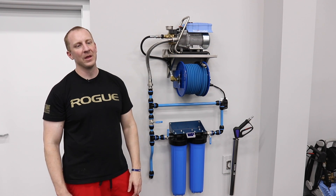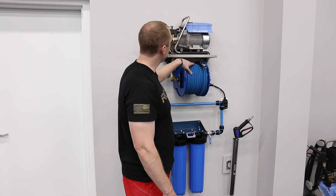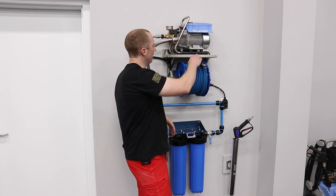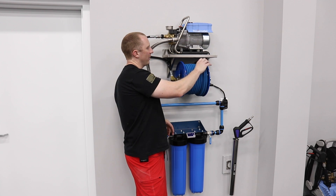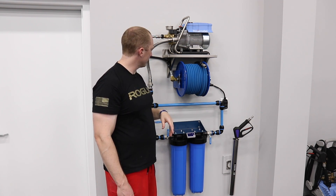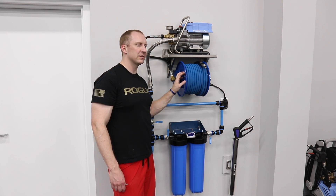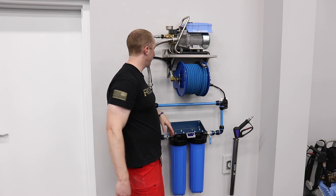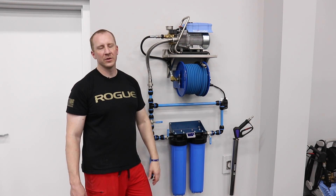The nice thing about this hose is it has a really clean termination — the jacket is nice and the fittings on the end are nice. I supply a 3/8-inch stainless coupler which connects to the wand and gun. I mounted the hose reel with five-sixteenths lags — four lags with some fender washers — right to the plate. You'll need to hit a stud since this is heavy, especially when filled with water. In my case, I did a stringer across the studs in the wall first.